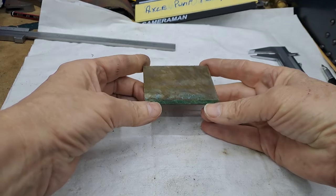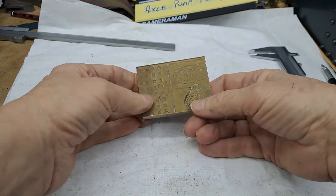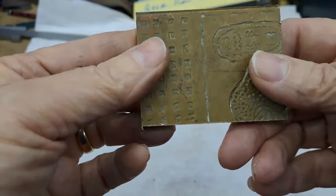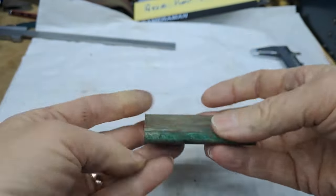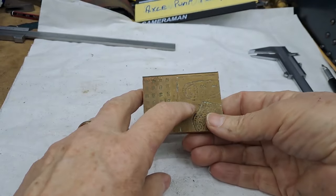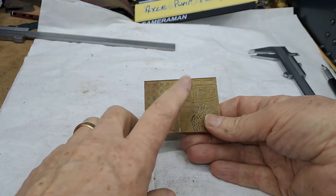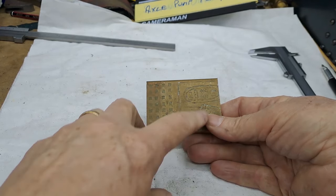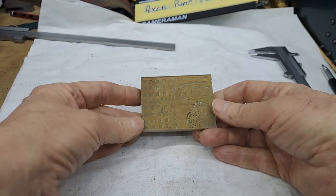We're going to be holding it in the vise there, clean off the back, flip it over, clean off the front. Hopefully these markings on here aren't that deep. They don't feel like it. And so we'll end up with a nice clean slab of brass to work with. It's then a case of marking the center, getting a big hole in there, which is probably going to be in the four-jaw on the lathe, and then the four corner holes to bolt it to the frame stay in the middle of the locomotive.